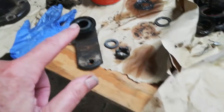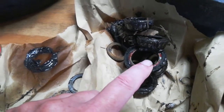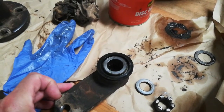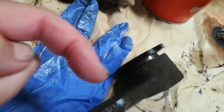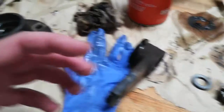So this piece right here is this arm — interesting, it was confusing to me. You see that red on there? That was one of the old seals. The new seals I put on — the old seals were driven and they had that face there loctited to that face there, so that the seal was locked to a stationary part of this arm relative to the hub, which is spinning once it's engaged with the ground.